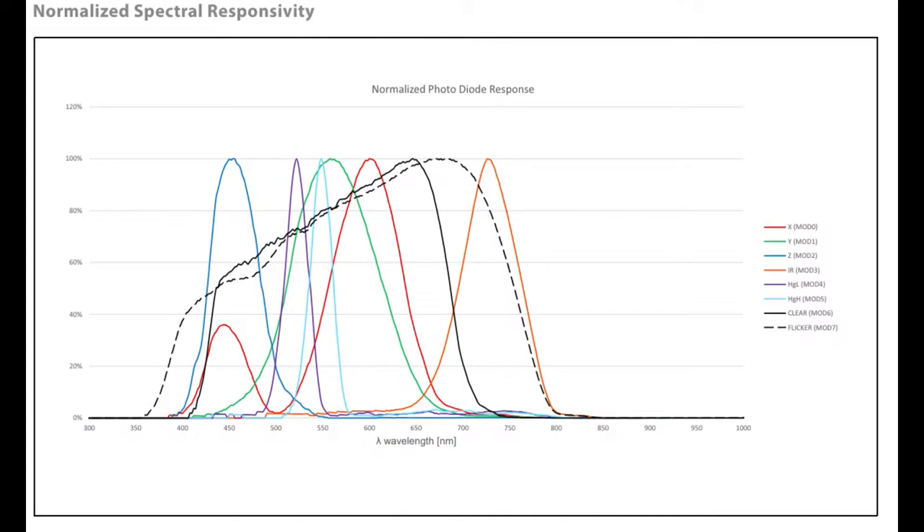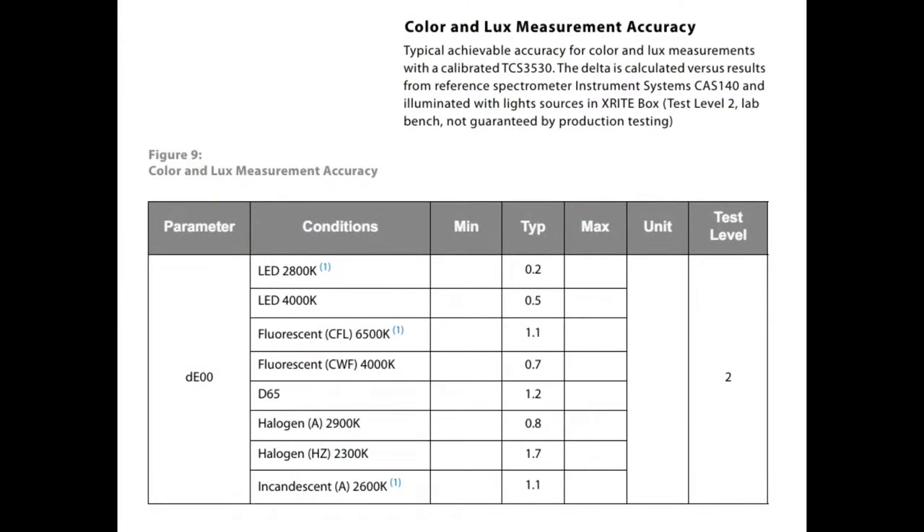All the diodes cover a really nice wide range — from about 425–450 nm up to about 750–800 nm. And they document measurement accuracy depending on conditions. The best conditions are roughly 3,000–5,000 K. You can use that accuracy data as part of your color tuning — for example, if you read fluorescent 4K light, you know how much to adjust to match expected accuracy.